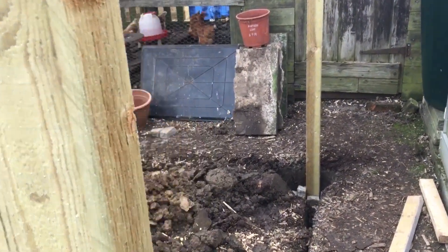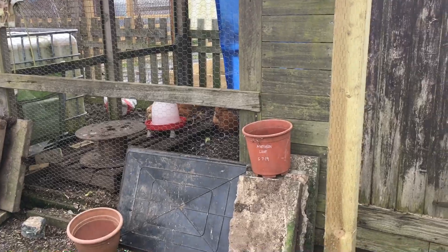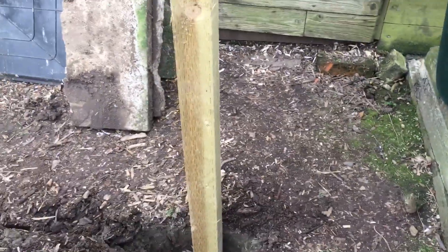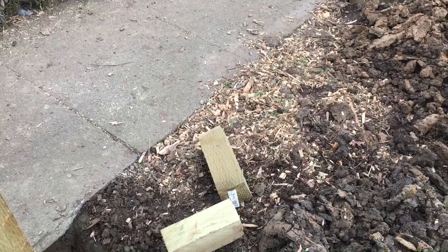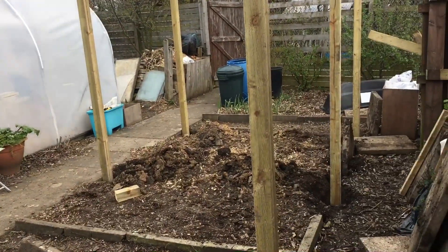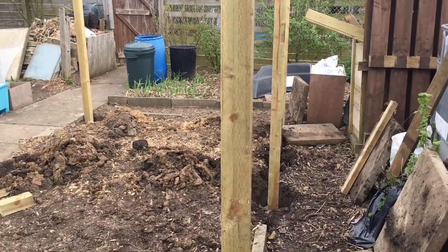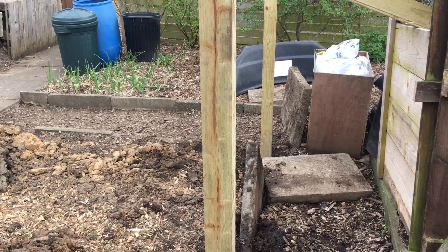It's meant to be 88.25 inches between that post and that post. I measured from there to there, and from the straight edge here to that post is 59 inches, so I did exactly the same thing on the other side. Because there was an incline coming up I had to dig deeper, so I cut the ends off. I measured from the edge of this post to the centre of that post — 195 — and got as close as I could to 88.25 inches. The end post is slightly off, so between there it's slightly less than 195.